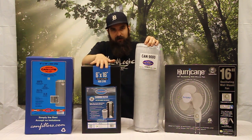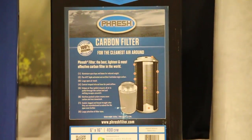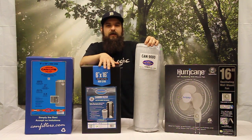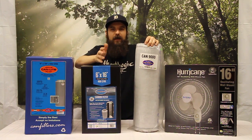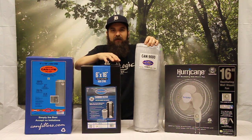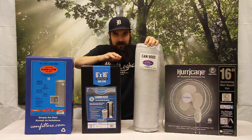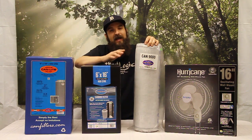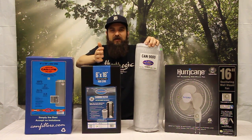Each gram of the carbon in these Fresh filters has a surface area of two football fields, so it's insane how much they can actually scrub for the amount of carbon in here. The longevity is going to be based on use, on airflow, and obviously the actual amount of volatile oils they've had to filter. They accumulate weight over the course of their lifetime — that's how you can gauge how old they are. Weigh it when it starts, and if you think it's going out on you, weigh it again. They'll add about a third of their original weight, and at that point they've become spent.